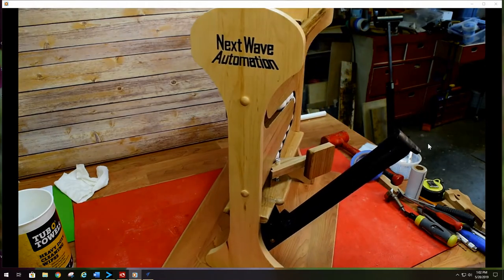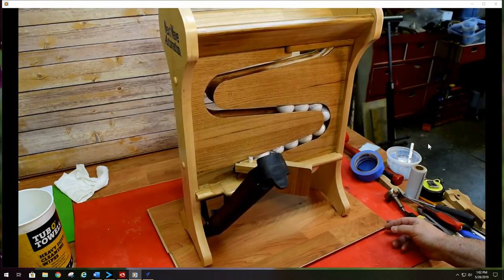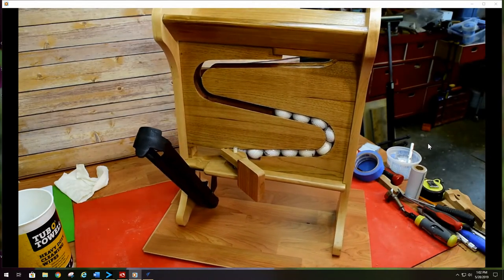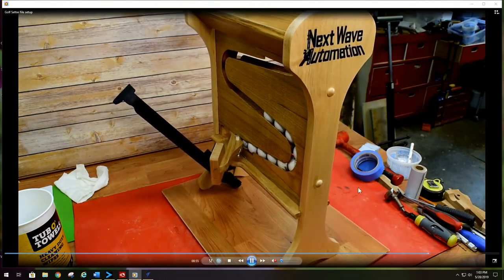Once satisfied with your settings, save the tool paths using the appropriate post processor for your machine. Check the tool paths by air cutting the project or using rigid foam board to run a sample tool path. Now you're ready to make your own golf ball setter.